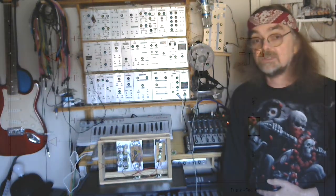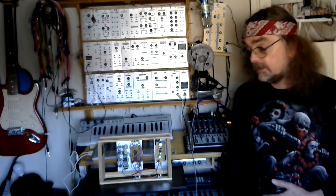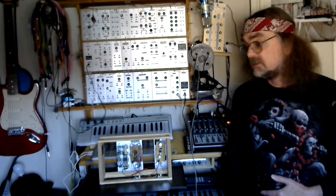So we'll have a look at the schematic diagram for it. This is the schematic with the gate buffer circuit added, just at the top of the diagram. You can see the op-amp with what's essentially a voltage divider. There's a diode in there which makes sure the signal is going in the right direction — a bit of crude rectification. The output is a nice buffered signal which will be just below the supply rail, providing a number of nice strong square wave type outputs which can be distributed across the other output sockets via the switches.